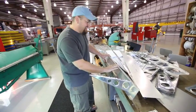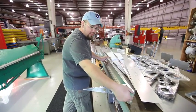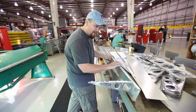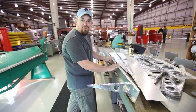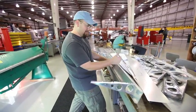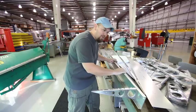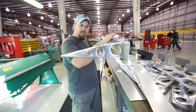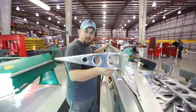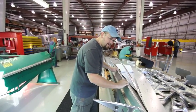It's a boy! This is actually incredibly exciting — we've got our angle in here just right, perfect height, perfect little flange. It fits snug, not too tight. We're not making airplane noises yet, but I can sit here with our aileron and pretend to be flying right now. This will be the spar for our aileron ribs to fit inside of — the nose rib will go up there — and we have a nice straight spar. We took our time and I am ecstatic. This is a wonderful feeling.